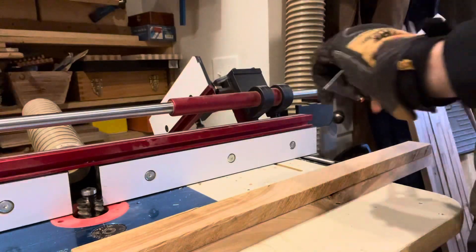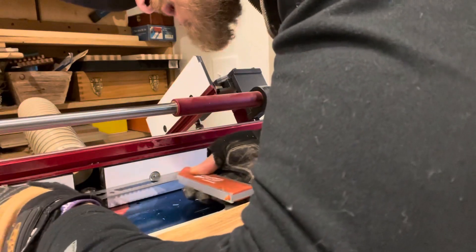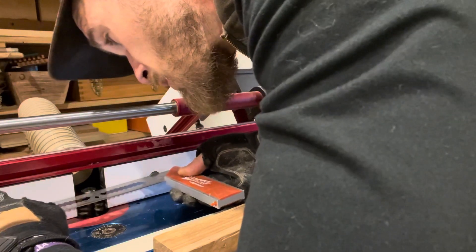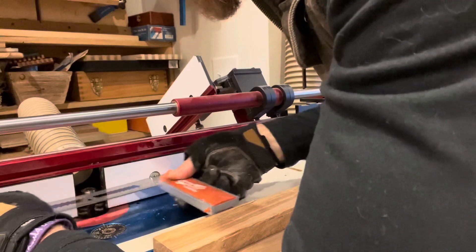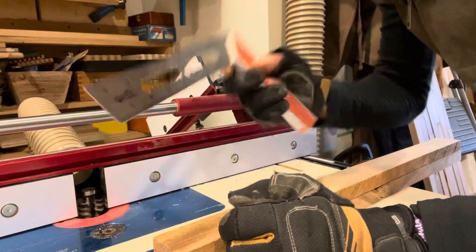The main thing is you take your square, make sure the power's off to your equipment. All you have to do — you don't have to make the fence even. You take your square because we have our cutter right here — that's the furthest cutting point — it matches the ball bearing. We're just going to slide the fence out until we're good with that ball bearing, and our square just touches it. There we go — that's really all you have to do. Tighten it up, check it again, and that ball bearing is actually moving. Now you're done with that part.